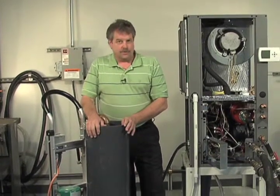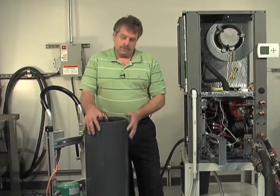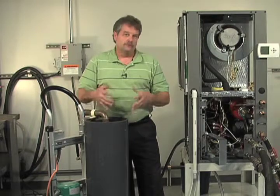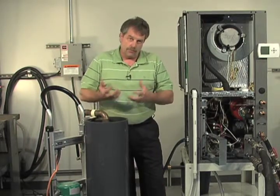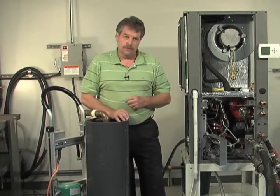You must have an adequate flush cart. What do I mean by adequate? You must have a tall cylinder that'll hold enough fluid so that allows the air to rise to the surface and dissipate rather than getting drawn back down and going into your loop.